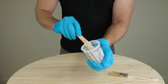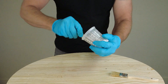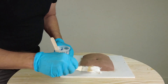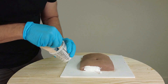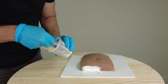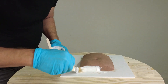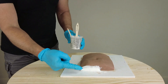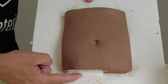An important detail is where you apply this test. The main area I want to make sure the silicone will cure against is where I applied that solvent, because before that solvent flashes off it can sometimes slow down or inhibit the surface cure. I'm applying it to the side of the piece — a part that would be easy to clean up if we did have cure inhibition. Always apply this to areas on your part that would be easy to clean up if, heaven forbid, you did have cure inhibition.